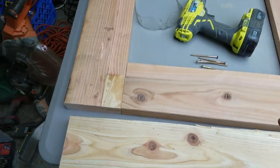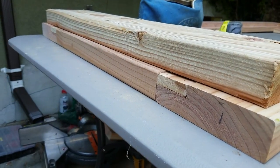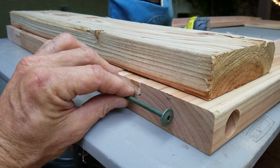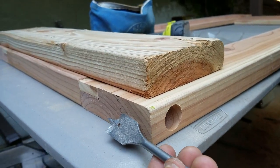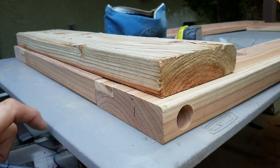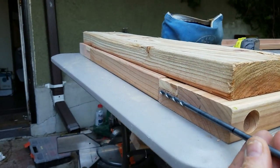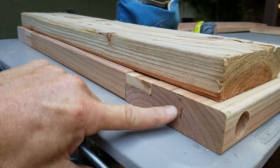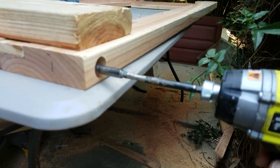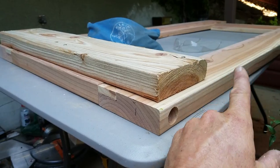Now I've got all my pieces cut and laid out. I need to drill a hole to get a 6-inch screw in here. The first thing I have to do is drill with my 1-inch spade bit so that the head can get all the way down there. Then I have to use this quarter-inch bit to get the drill through, so I made a little mark on the bit to take it down to the right depth — basically drilling through the whole 2x6. It's important to get these lined up straight so they don't poke through the side.